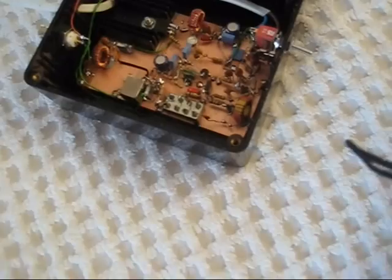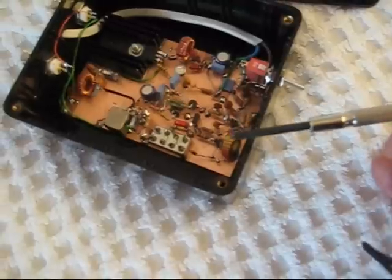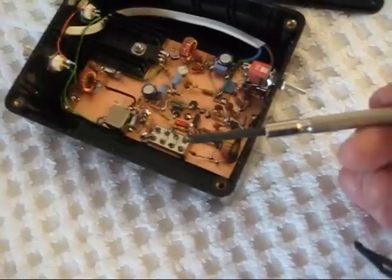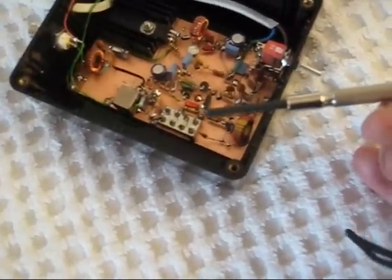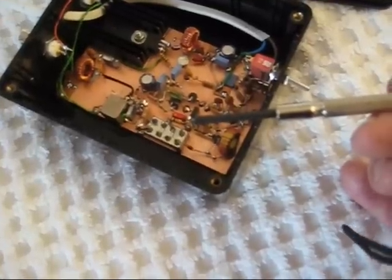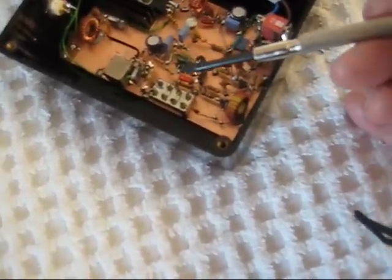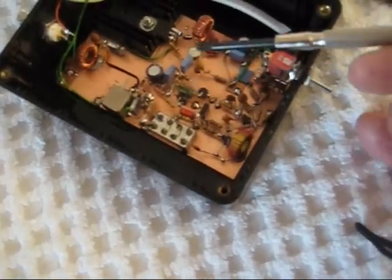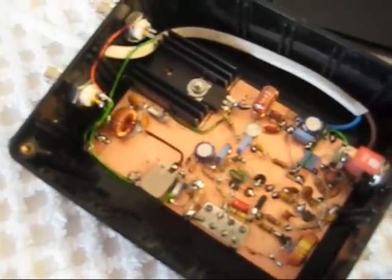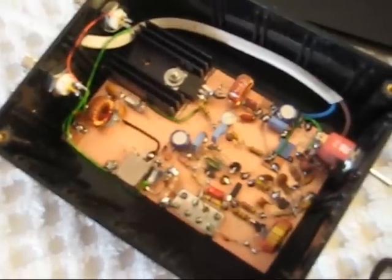If you can see the detail, the oscillator starts here — a crystal oscillator producing about 10mW into the double balanced mixer. The double balanced mixer feeds the signal which is transverted from 28MHz down to 500kHz, through two stages of amplification and then finally into the big device here, which is the IRF510 PA.